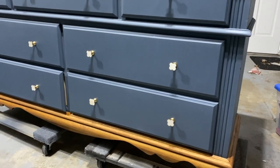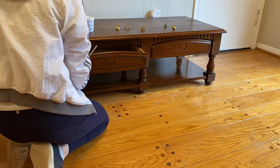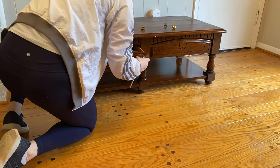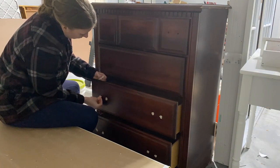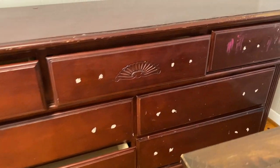The next thing you'll need to do is decide what you are going to replace the old handles with. If you are replacing with a handle or knob with the same hole pattern, then your job here is pretty much done and you can move forward with paint or stain using what's already existing. But if you want to move the location of a handle or knob, or you're just using a different hole pattern, then you'll need to fill the old hole and drill out new ones.